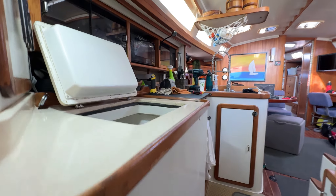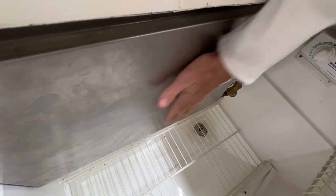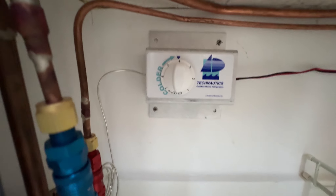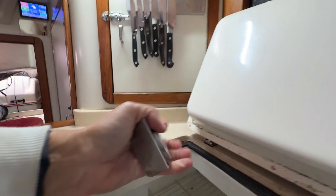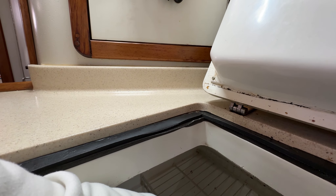There'll only be two bends. Going through the hole, pulling this away, and then once we come off the wall there'll be a little 45-degree and then a 90 down to the plate — into the quick connects. There's our tubing, so you've got to unroll that carefully. That's probably the most sensitive part of the job. The good thing about copper is it's soft — you don't want to kink it, but you can make a slow radius.